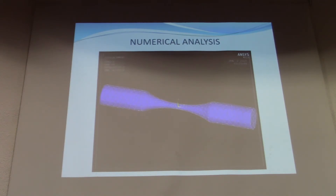This simulation was carried out to calculate the natural frequency. As you can see, the result gives a natural frequency of 20,100 Hz, confirming this is a valid specimen geometry for ultrasonic fatigue testing.